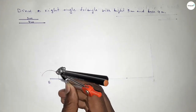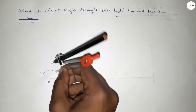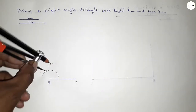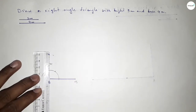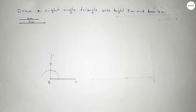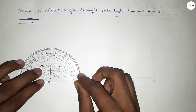With the same length, putting the compass here and cutting here, then putting the compass here and cutting here, and drawing an arc again with the same length, cutting here so both curves intersect at a point. Joining this side to get a 90 degree angle — checking — this is perfectly 90 degrees.